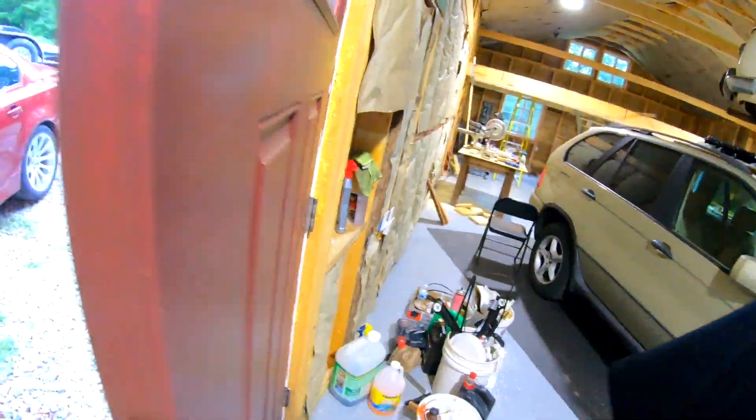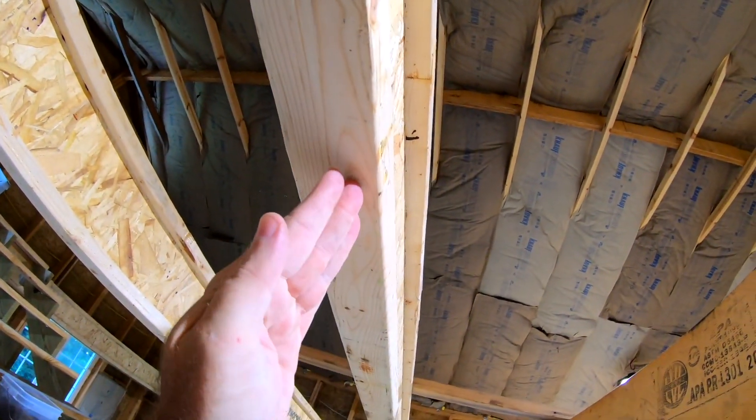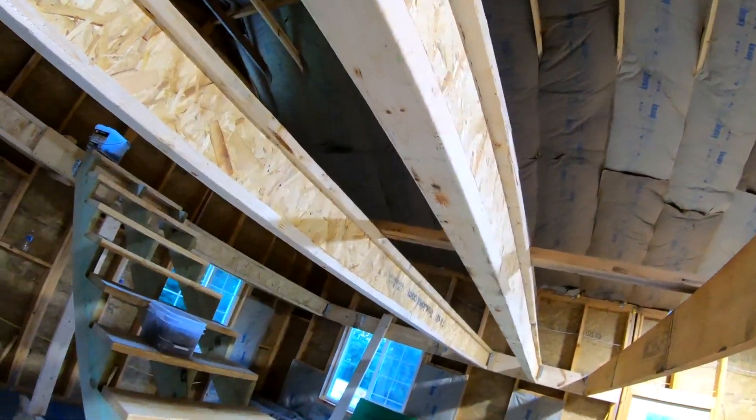So that's part two of the loft build. Part three is going to involve getting all the stub walls up and all the joists in. I did get the OSB — we're going two foot on center joists. I got all the OSB on the trailer and we're using three-quarter inch straight-edge. A lot of people say tongue and groove squeaks, and it was about the same price so I went straight-edge. The nice thing is we're going to have two and a half inches to hit the seam instead of inch and a half with a two by ten or two by twelve. Part four will be putting the subfloor OSB in, and then we'll be done. Thanks for watching, have a good day.